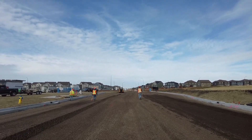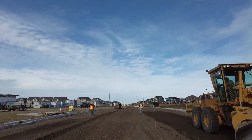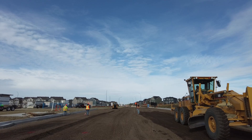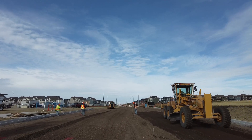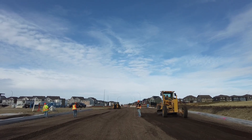The reason why Jesse has to be down and not on top of the curb is because the grade we're given in the centre is for the gravel lift, not the final lift. If we had it set up for the final lift, then he could be up on the curb.